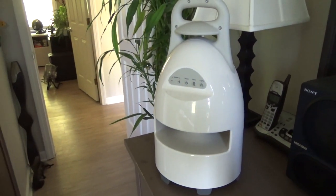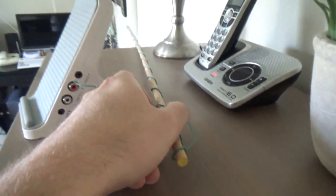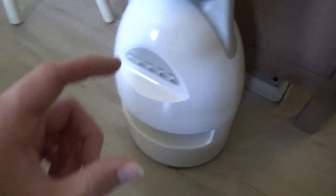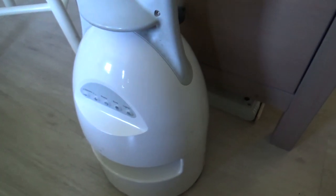So to try to fix it, I've done a couple of things here. I've modified one of the transmitters — I have two transmitters, this is one of them. This is obviously not a practical design, this is just experimentation. So I put this lengthy antenna on it, and in the speaker, what I did was I took a piece of wire and attached it to the internal antenna, which is only about that long.